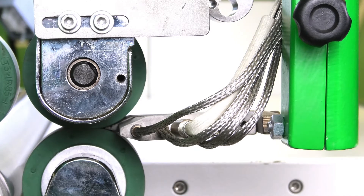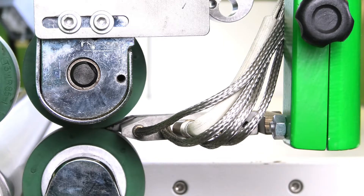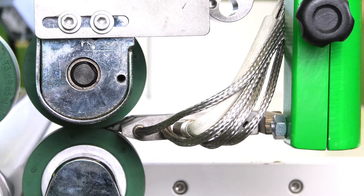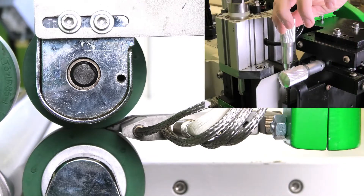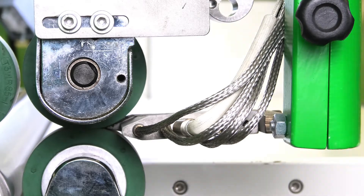When I'm doing acrylic, what I like to do is move the wedge up so it's touching the top wheel just a little bit more than the bottom wheel, because I have to heat through the tape to make contact with my top layer of material. So I like to have just a little bit more tension up top.